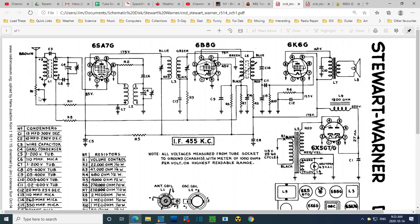So this is not the simplest thing. This end of the potentiometer here doesn't go to ground directly. It goes through this small 50 ohm resistor, and then it finds a signal ground here. So what's going on with this? Now, from the antenna point of view, it's pretty easy to figure out. If you slide this all the way up here, then you've applied a chassis ground right to the antenna, and you've got nothing across this coil. You got nothing going into the radio.